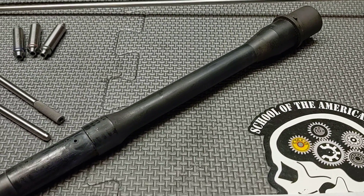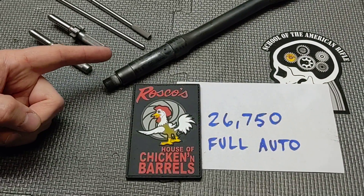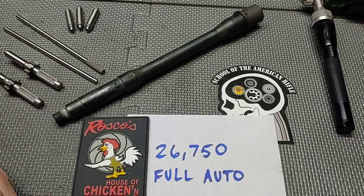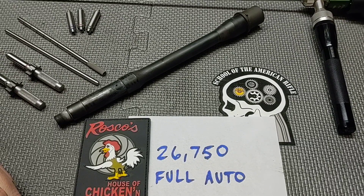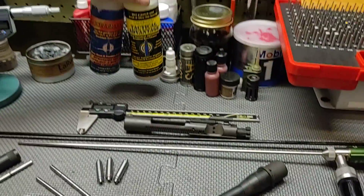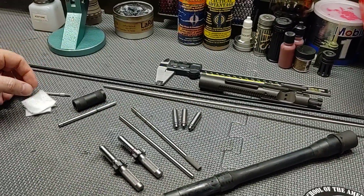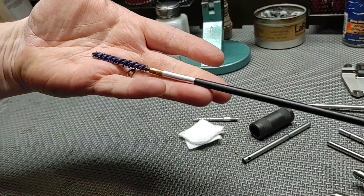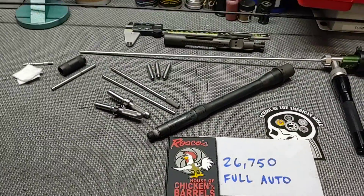I've got to grab my throat erosion gauge — I don't have it laid out here. We will be pausing the video for a minute. I'm going to give you a bore scope image of the barrel dirty. We're not going to gauge it fully dirty because it's going to give a false reading, but the barrel is still heavily fouled. I'm going to clean it with some Wipeout, which is a brushless bore cleaner — just a patch and jag. Worst case scenario I will use a nylon brush; I do not use bronze brushes unless something is severely corroded.